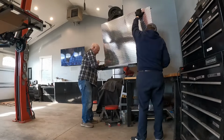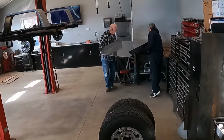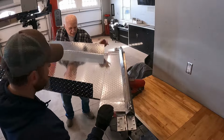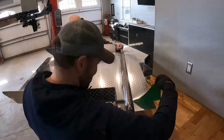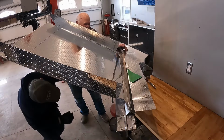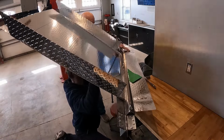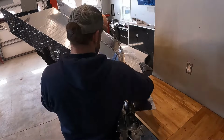And setting up for the third bend also went pretty smooth. The only thing different about this third bend is it doesn't get bent at 90 degrees. It gets bent to about 39 degrees, was the measurement that I took off the cardboard template. Ended up making a template out of some green tag board. Just took a protractor, measured out a 39 degree angle, and then cut it out. And I used this to visualize if I had the bend at about the right angle.